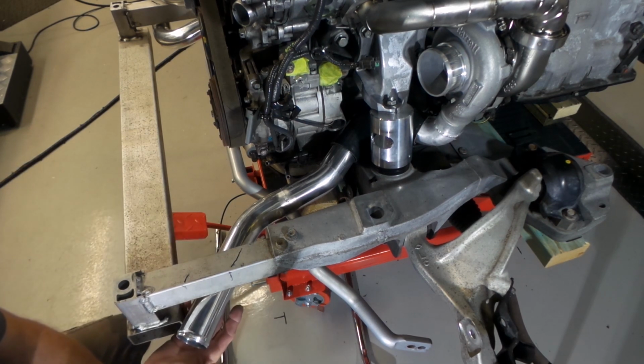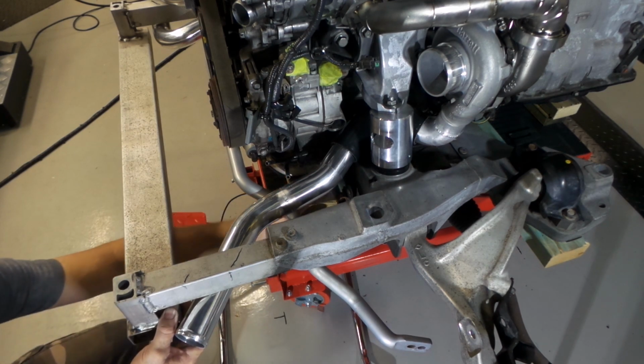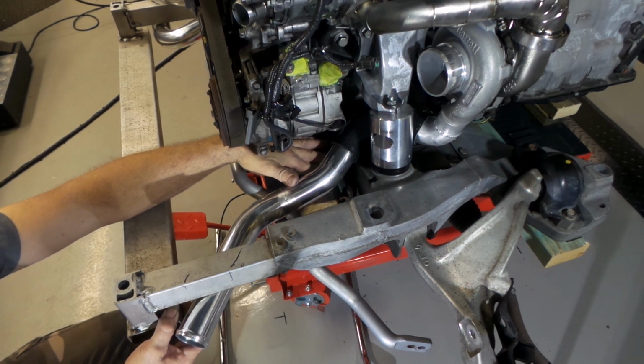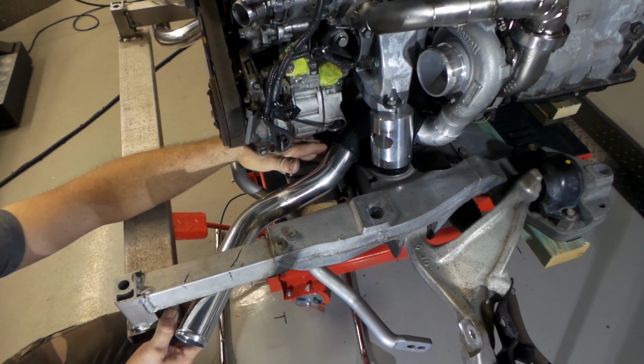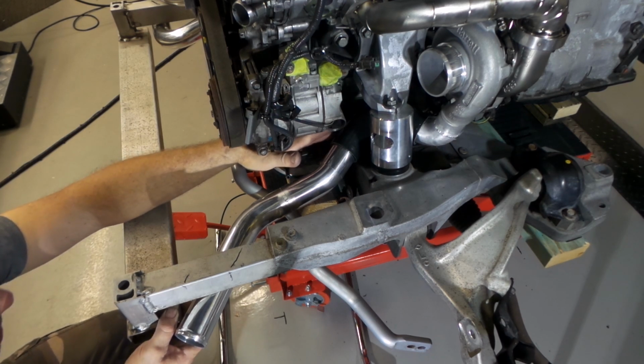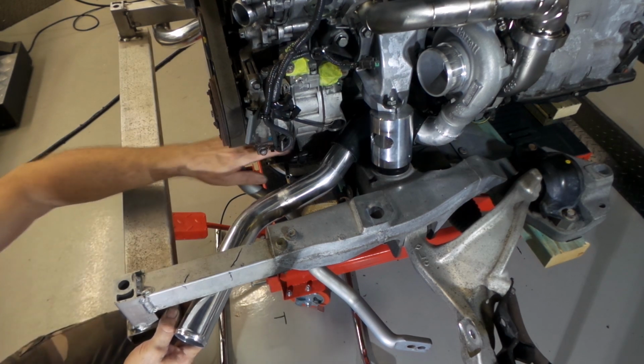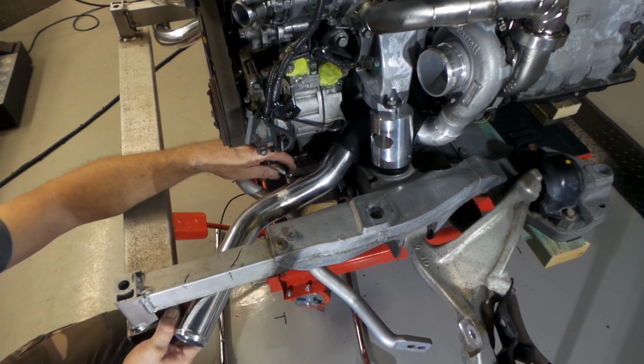Well, at this stage I think that's actually pretty good. It's clear for my turbo oil drain down here, which you probably can't see, that runs into the Z1 oil pan spacer I've got on there. And it's clear of the pipes. There are a few other little electrical connectors and things. These pipes for the transmission are clear. I may be ditching these though and making up some new lines for this. I don't know, I've got to suss that out.